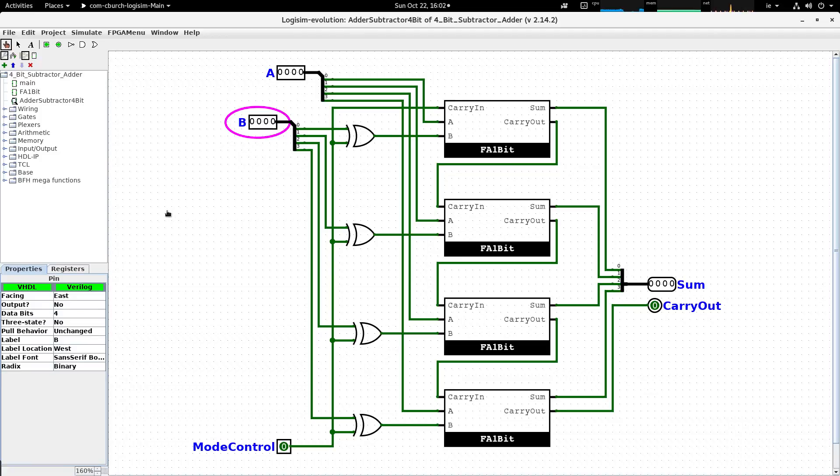In this video I'm going to review the operation of an adder circuit which can not only add two four-bit numbers, but which can also perform subtraction. This circuit is being simulated in Logisim. It's a four-bit parallel adder-subtractor, discussed in the lecture note on adder-subtractor circuits, and I'm going to demonstrate the operation of the circuit.